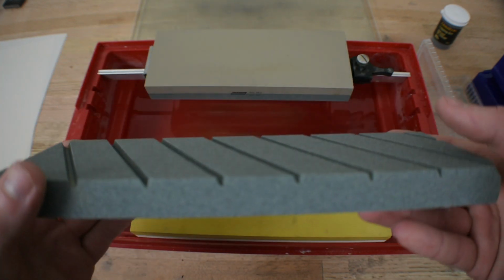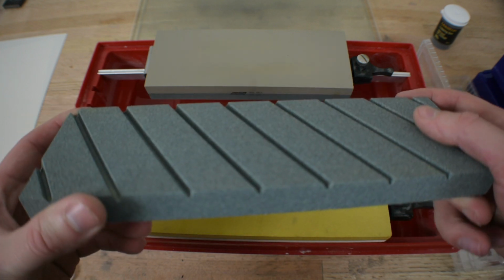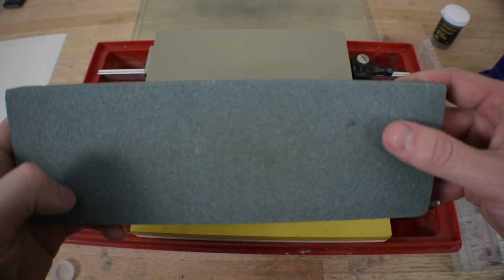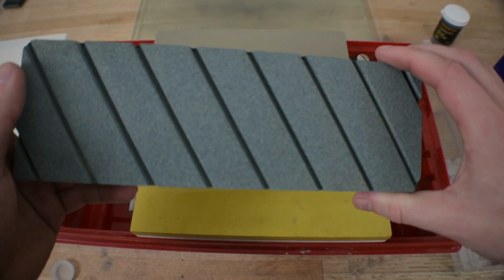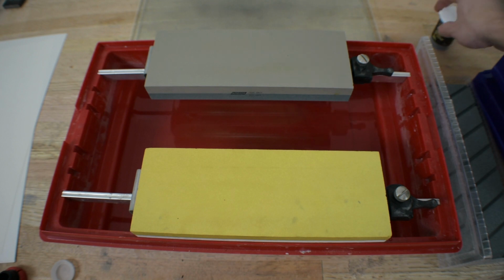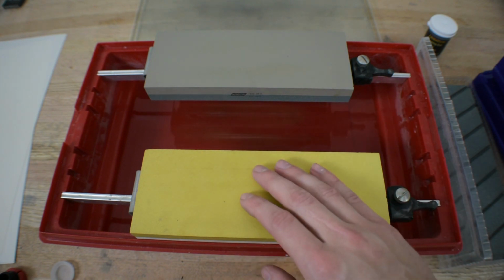So what I ended up having to do is find something with a higher grit and lap out my lapping plate. So this is flat now, along with the underside, so I can use it for just really grinding out the bottoms of chisels or whatever needs just real rough work done to get a chip out or something. So I guess some of the alternatives is the lapping grit that I mentioned earlier. You put it on that glass plate and it will actually flatten your stones.